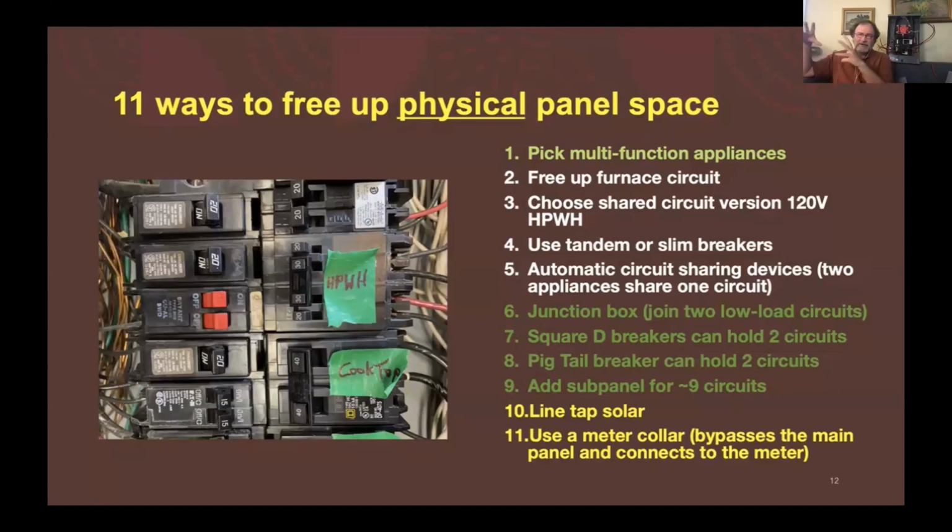And then even if you're using a mini split system, either central or ductless, both of them from the Japanese makers in particular, I know they have an umbilical power cord coming in from the outside unit that powers the air handler in the building. So it can power that thing that looks like a furnace that's now just an air handler, but it's not on a separate circuit. It doesn't have to be. It's on the same circuit powered by the outdoor machine.